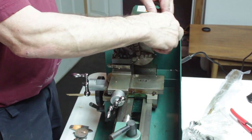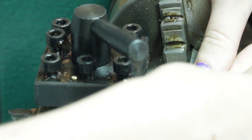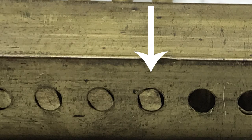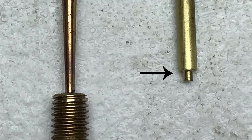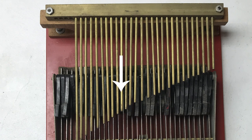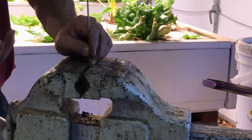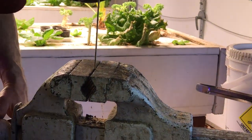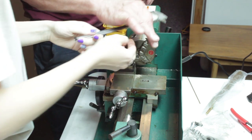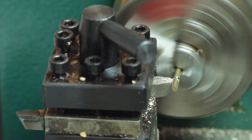This process took a bit of experimenting. What we discovered when we broke off one of those chime pieces is that every brass rod consists of a 3/8-inch base that slides into the brass base piece of the chime. It's crushed on the end so that the brass rod isn't touching all the sides of the hole in the brass base, to allow for some vibration and a pitch. After that base is a small chiseled-out section of relief which lets the rest of the rod vibrate. Then you have the length of the brass rod — the length determines the pitch. We took our 12-inch brass rods and cut them down to 1/8-inch size bigger than the rod before it on the keyboard. We then crushed the ends in a vise to create that crimped edge in the base. Then I was allowed to operate a jeweler's lathe — which is dangerous — and I was left alone with it to cut in all of the indented vibration points. At 3/8ths from the bottom, I cut in a 1/16-inch relief that allowed the rod to vibrate.